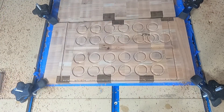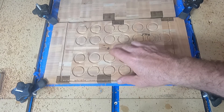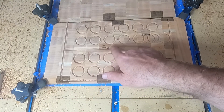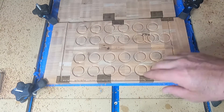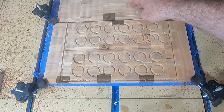Well, this is one of those pay-close-attention-before-you-hit-go moments. When I initially wrote the program, I had it set to go from the bottom left corner, but I had centered it here on the center — so these ones are going to be messed up. I'll probably end up just cutting this down. I have a couple other smaller ones here; maybe we'll keep this one for ourselves. Let's go ahead and get the centers of these cut out, and then once these are all done we'll get the second one going.